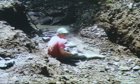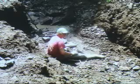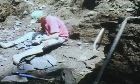When you start, it's getting fairly clean in the hole, but then if it rains you get a little seepage, and eventually it starts to get muddy. You can see the mud down there. But the layers here come out in nice sheets — you can get pretty big sheets, and you can see the nice vertical cuts of the rock. I've seen that in several other places too, where you get these nice seams, which really makes it easier to get the rock up. You drive the wedges in, you get a nice big chunk and peel it up.